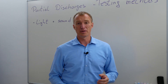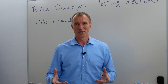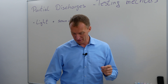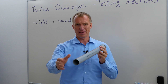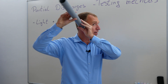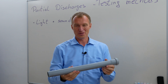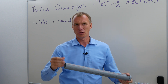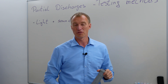So if you don't have such a directional microphone and you're rather close to the area where the partial discharge is happening, there's a trick you can do. This comes from a German guy who lived and worked in Austria for a long time — he had a very good idea. You take a plastic pipe — the longer the better, especially when talking about high voltage — and he was literally using that to figure out where the sound is coming from. It worked quite well. Just make sure it's not conductive, and that's the easiest way to detect partial discharges and figure out at what point in your high voltage setup you actually have problems.